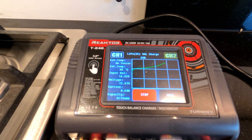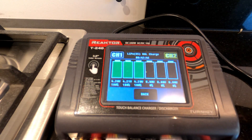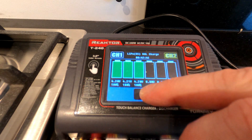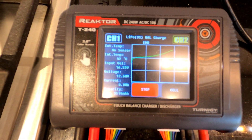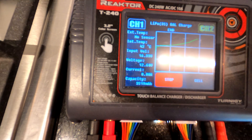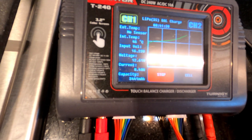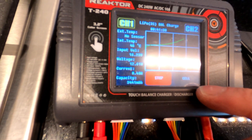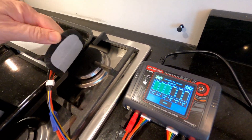Okay so that's both the Radiant ones done, and as you can see 42 minutes on that battery to charge from LVC up to fully charged. You can see that's 100% charged — 4.2, 4.2, 4.2. And you can see quite clearly there that has only taken 3519 milliamp hours. That is supposed to be a 5300 milliamp hour battery. The second one took 3444 milliamps from LVC, 41 minutes to charge, and again that's fully charged.